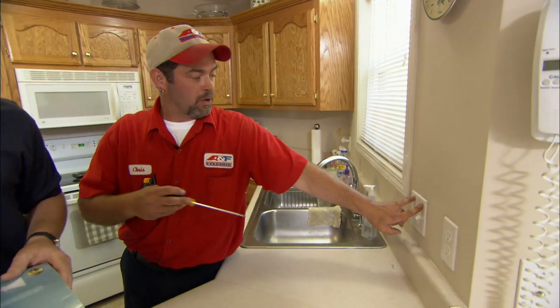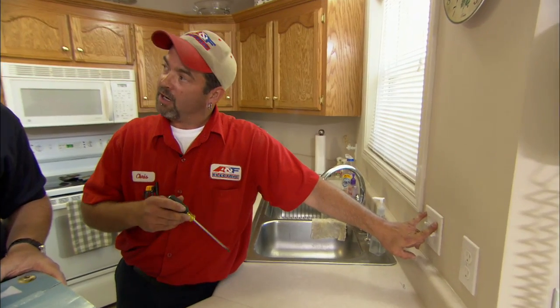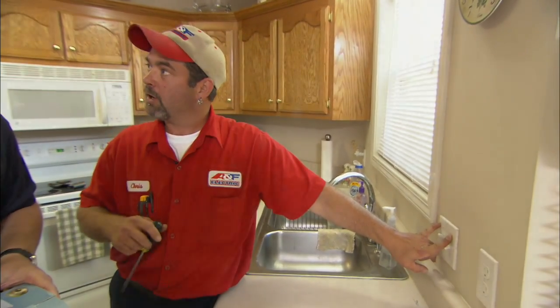Power requirements — what we're going to use to feed these with. We've got a two-gang switch here that we're going to change out to a three-gang, and add a dimmer for the three pendants over the countertop.